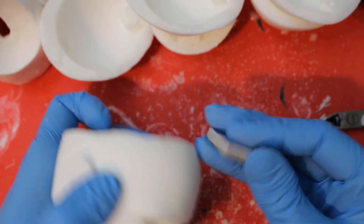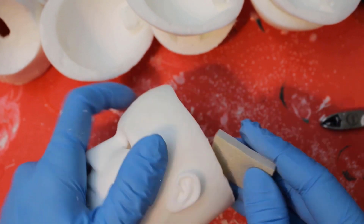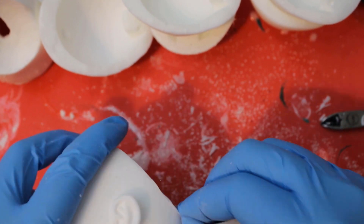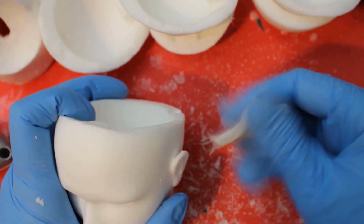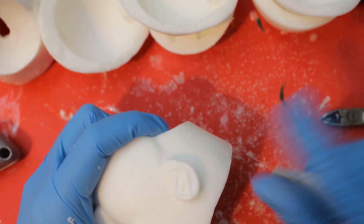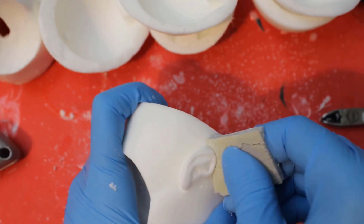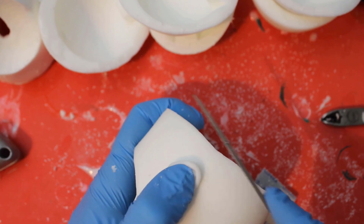Because I cut the mold, the space above the ears and a little below the ear on one side have a little bit of a seam line that has to be sanded off, but it's nothing too severe. I start my sanding on the seam lines and for smoothing the edges with a 320 grit Tamiya sanding sponge, and then I finish using 3M 600 grit sandpaper.